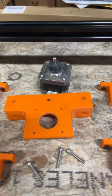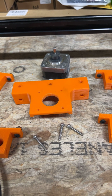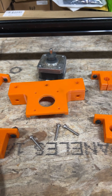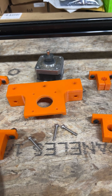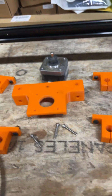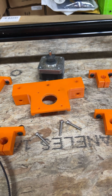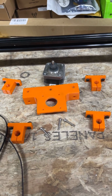And then this, you get 2 steppers on your Ender 3 for X and Y. This is the Y stepper motor, and I use the Y stepper motor on the Z simply because it's got a longer shaft than the Z motor does, and I didn't feel like switching out the shaft on this one. I do have jigs in the file set so that you can pop one of these motors apart, push the shaft out either with a punch and a hammer or a press, or there's multiple different ways to do it, and I'll actually make a video on that too, because you're going to need to convert or buy a dual shaft NEMA 17 for the Y axis unless you go Core XY. And so I'll be showing a little video on how to swap out the shaft. Doesn't really take that long.